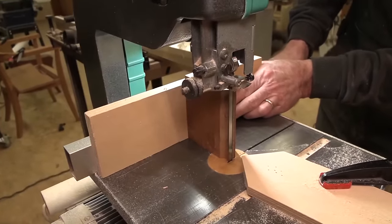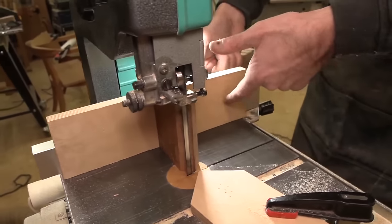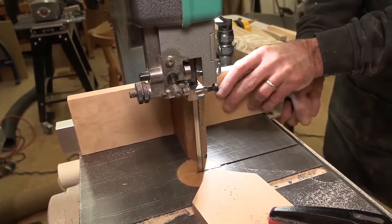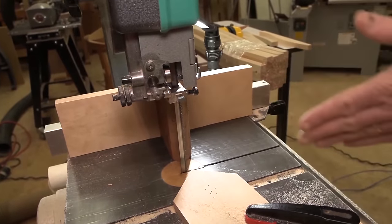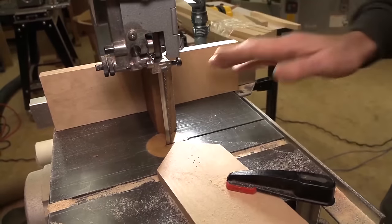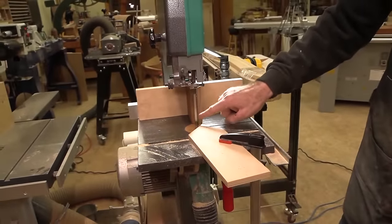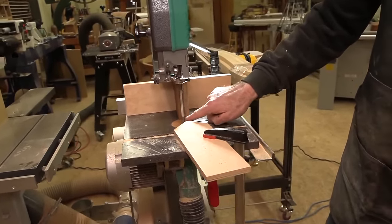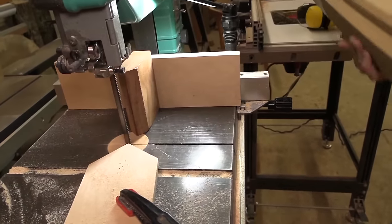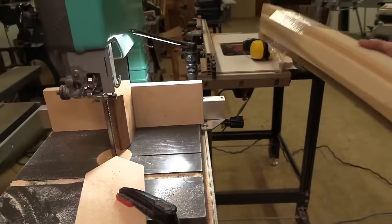line it up just in front of the blade, and I'll put some clamps on here, and I'll clamp it across here, across there. Then I can just move it away whatever distance I want on either side of the blade, and then feed again, bearing against there. So there's a lot of different styles you can use, but essentially it's the same principle. You just have a triangular kind of point here that you're bearing against. With thicker material, like this was almost 2 inches thick, I bore against that and just rolled around. I just had to clean up the back side.